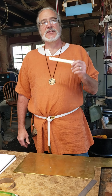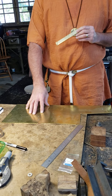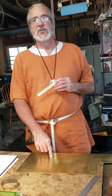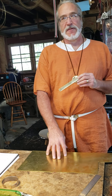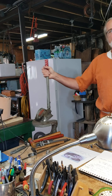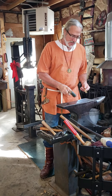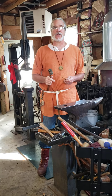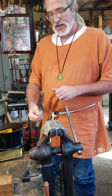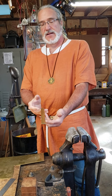I'm going to go over some of the steps I had to take to get this coupon made first. I get my brass 260 — also known as cartridge brass — out of my stockpile, and I had to decide the size of coupon I was going to make. In this case, it's two millimeters thick by three quarters of an inch wide by seven inches long. I cut off this coupon using shears, and then I had to take it to the anvil — it was curled and twisted from the shearing process — so I had to hammer it flat and put it in the vise to straighten it out so it's now nice and straight and flat.